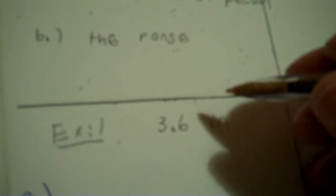You have one decimal place, so you make your decimal point wherever the last digit is. You make that a one and everything before it becomes zeros. Now here's how you find the range: you make a plus-minus expression. You're going to plus-minus not the 0.1 — you need to take your 0.1 divided by 2. You always divide your degree of precision by 2.